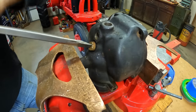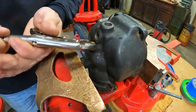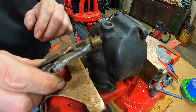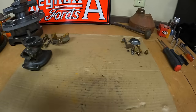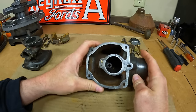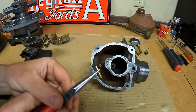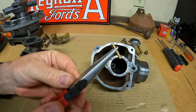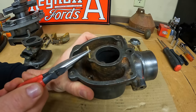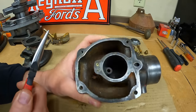Remember, this is not threaded — there we go. So this means we're down to just that broken off low speed jet in the bowl assembly. I'll show you what it's supposed to look like — I've got the new one here from the kit. It just sticks straight up out of the bowl like that, and the threaded portion at the bottom goes in until you run out of threads, then cinches in. It's got a very tiny little hole through the center.